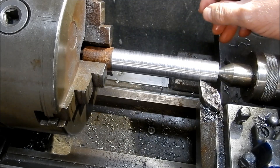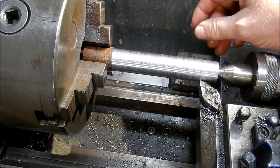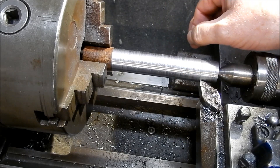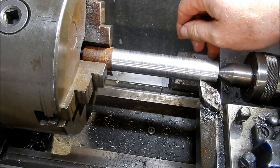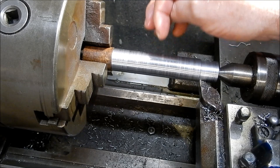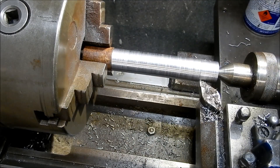This is a technique I picked up in a machine shop I worked at many years ago. A big Dutchman called Jerry Buzum used this quite extensively on pivot pins for big clamshell dock loaders. It's ideal if you've got multiple shafts you want to machine all to exactly the same size in one setup without having waste material at the end with a drive dog. I'm just going to roughly machine this down, flip it over, and machine the other end — this is just a bit of dirty old bar stock I found in the dirt down at the scrap house, so I don't know what it is and it doesn't machine too well, but we'll show you the technique anyway.